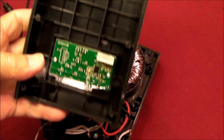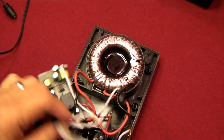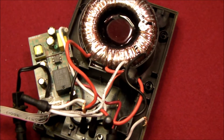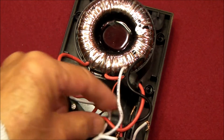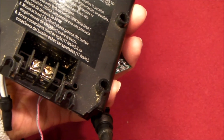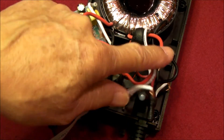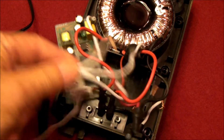So I've disconnected the switches and everything from the control board using this ribbon cable, and I'll discard that. Next thing is to figure out what's important and what's not important inside this. The way I look at it is this is a toroidal transformer — it has input and it has output. It looks like the two heavy red wires are the output, and the input looks like it's the black and the white wire. So everything else can be discarded.